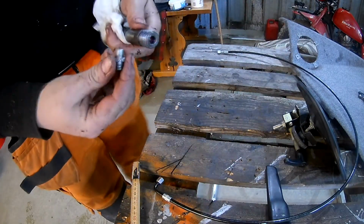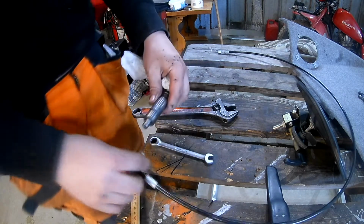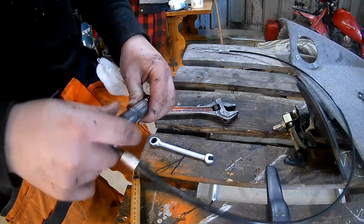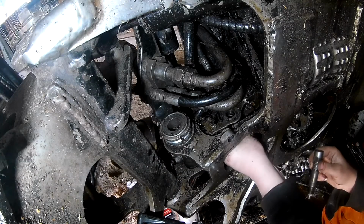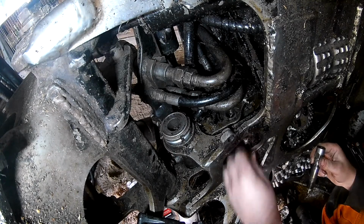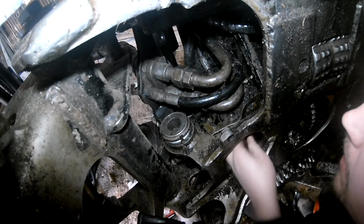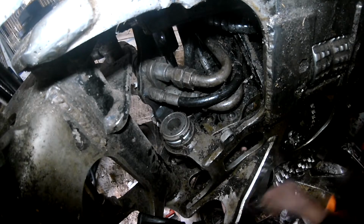Here is the hose that was bought to address that, and since there was no hose there when the machine was bought, I didn't really know how to connect it and had to play around a little with what would fit. This was incorrect. I needed a 90-degree angle on there to have a chance of getting this to work. So did a test fit, getting the axle in place, putting on a 90-degree fitting.